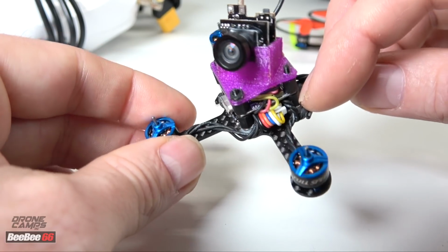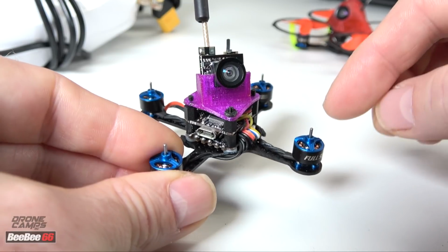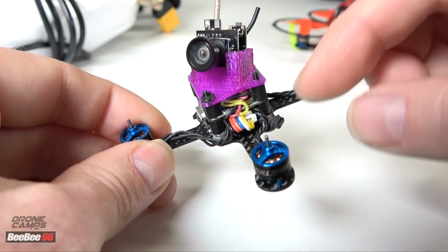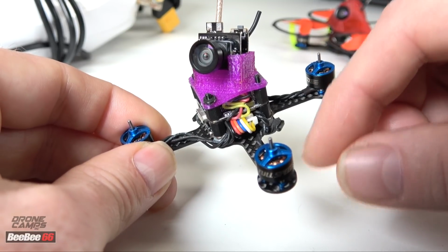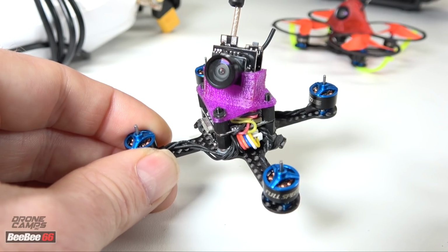And that's pretty neat. It also supports D-Shot 600, so if you're setting that up in the configuration, you want to set that up on D-Shot 600 inside Betaflight, and you also want to up the motor timing to about 7 so that you get the best performance out of these ESCs with your high voltage battery.